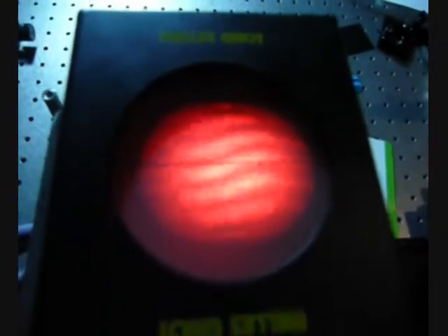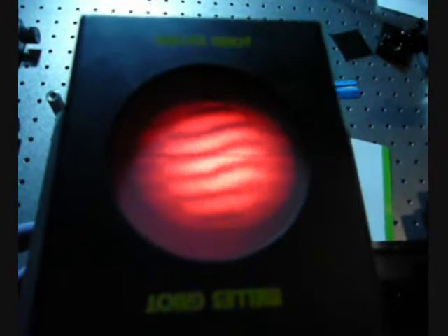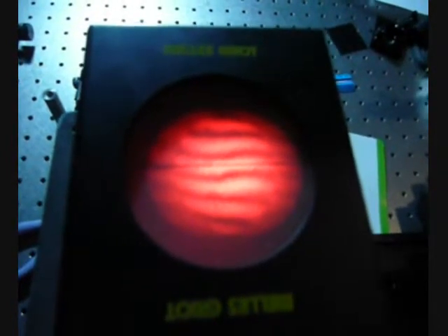As you can see, we're cycling through our fringes. What we're also doing when we cycle through our fringes is changing our angle. This is because to tilt the mirror we have to push the mirror a little bit, so we're adding defocus. We can then take that defocus out using our lateral translation along the z-axis and come back to what appears to be collimated. But we know that there's tilt in this because those fringe orders, though they appear the same, are different orders than the ones we had previously.